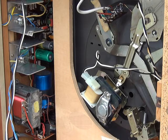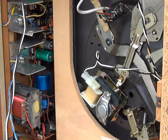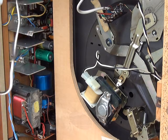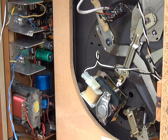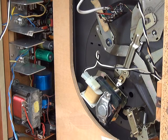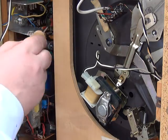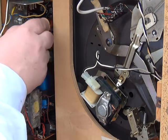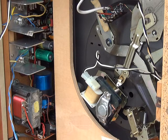We've got the bottom off as you can see, and we've got it on its side on the bench. The model is the 2400. We've shoved the wires into a connector block to a plug with a one-amp fuse in — just the kind of thing we do; the sockets here are all earth leakage circuit protected. We'll be taking the electronics out and that'll be a separate video. One of the reasons we don't power these up when we've just bought them is these electrolytics — there are some orange ones there, and if there are any of those dreadful black ones they need to go as well. There probably aren't that many — about six or seven — so it's not a big deal, change out of seven pounds.